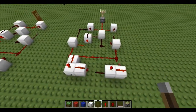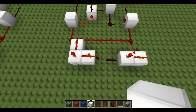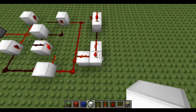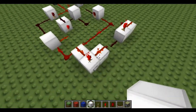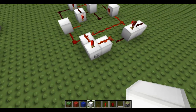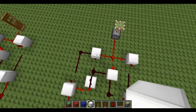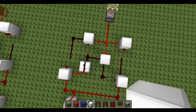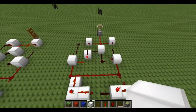It's split up into 3 parts really. This L-shaped bit and this bit here — there's one part — this is a signal shortener. If you watch this bit here, it will flash briefly off. And again — so that's the signal shortener. And then you've got the RS NOR latch and 4 inverters, which together make the T flip-flop.